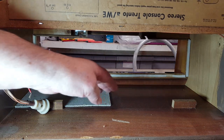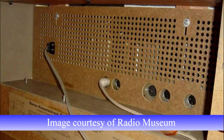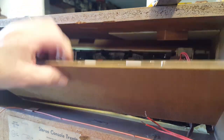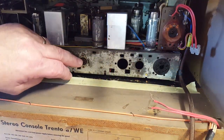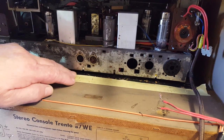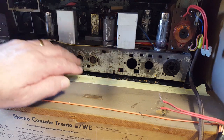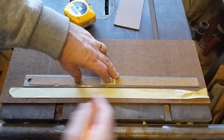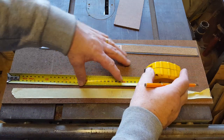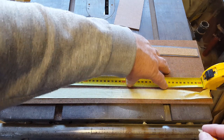I said earlier there was a back panel that goes on here - it's been taken out and discarded. I've found a photo of it and I'm going to try and replicate it. I've flipped the radiogram over now. I've cut a bit of masonite panel and I've got to drill holes for the DIN plugs and speaker plugs. I put masking tape along there, measured from the edge - 260mm and 288mm - and transferred those measurements onto the masonite. I'll mark the three holes at 260mm and 445mm.